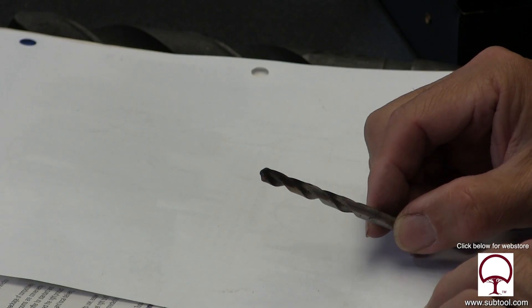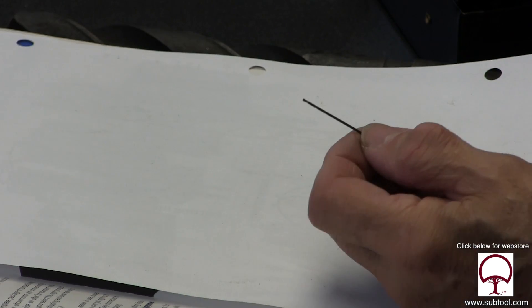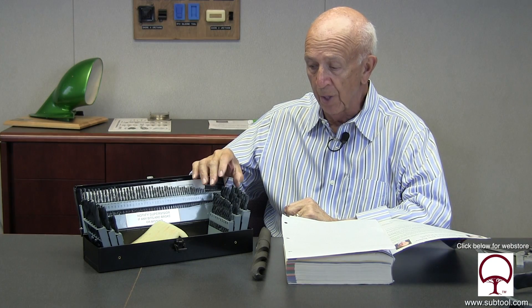So let's take a look at a standard drill. Here we have a drill that needs to be sharpened. I want to give you an idea about the sizes of drills, because when sharpening a drill like this one — this is 40 thousandths — the only way you're going to do that is with some kind of a magnifier, because unless your eyes are really super good, you can't see what you're doing. Looking at this set of drills — a number drill from 60 all the way up, then fractional drills, and alpha drills — all are necessary depending on the type of hole you're going to tap or prepare. That's why there are three different sets and three different sizes.